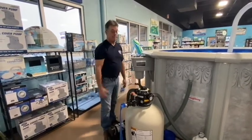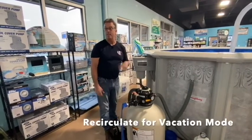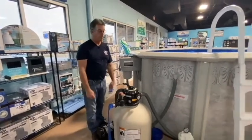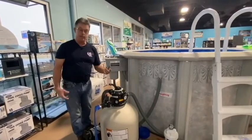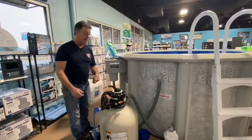Recirculate is also used if you're going to be going on vacation for an extended period of time and no one's going to be around to backwash for you. You can put it on recirculate, and it just won't filter the water for you, but it also won't have to be backwashed while you're gone.